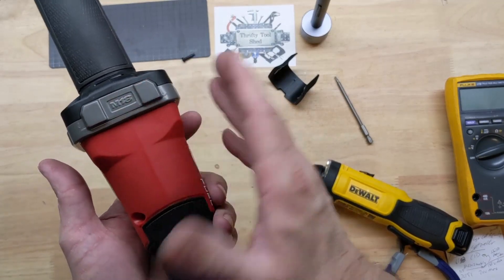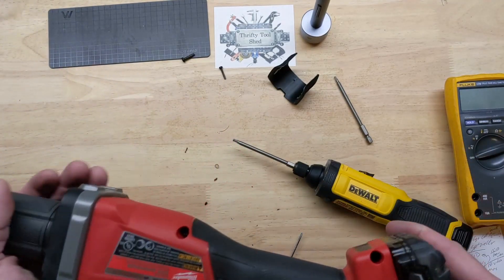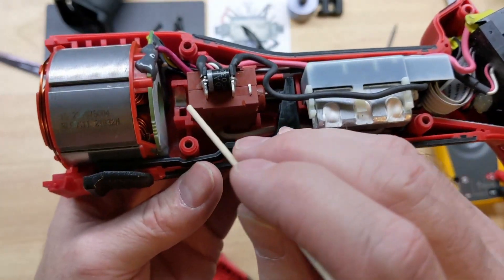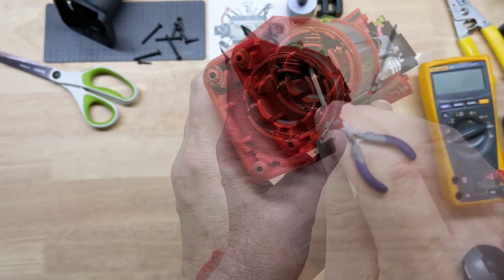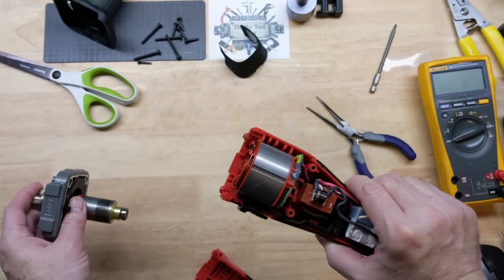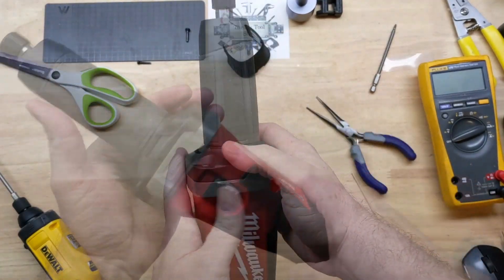What I've done here is flipped this around — I'm just trying different spots, 90 degrees at a time. Not still hitting, but it still has a high-pitched sound. So one thing I've done here is take a little shim from a nickel strip and super-glued it onto the bearing housing in the same place that we're rubbing. It's going to help keep that bearing up as well as we try to get the alignment correct. We'll see how that goes when we put it back together, tightening up as evenly as we can get it.